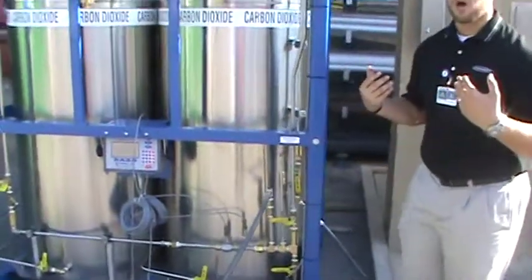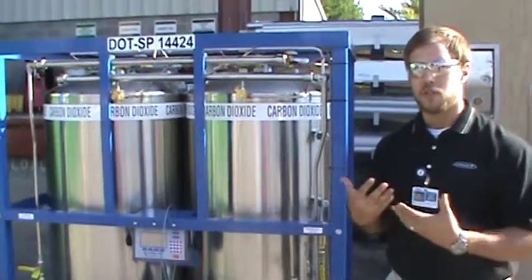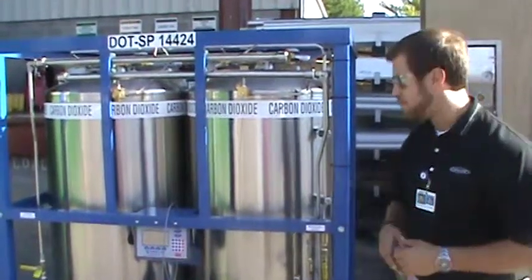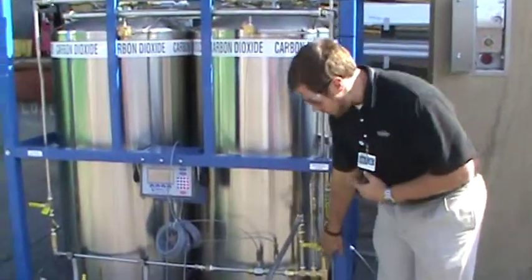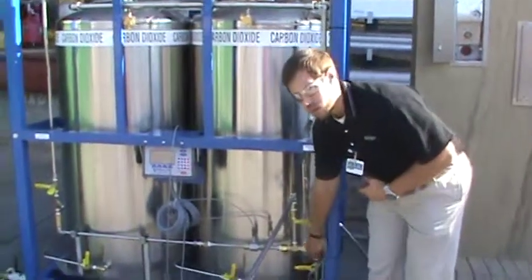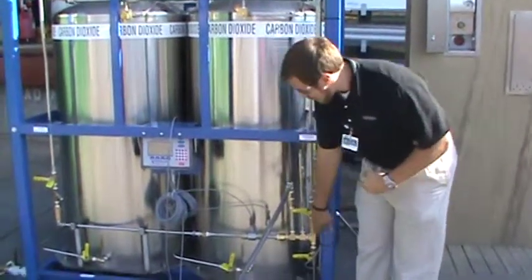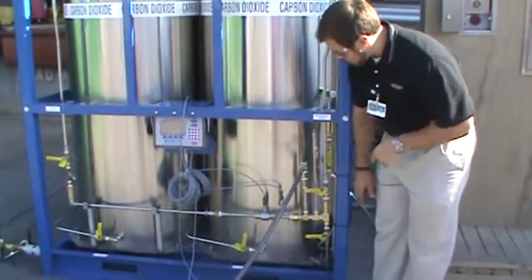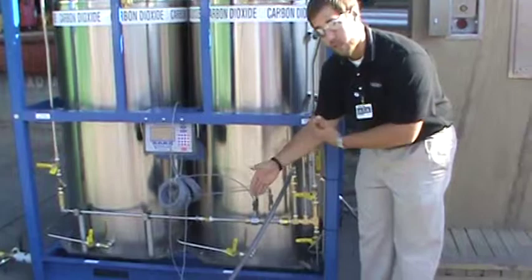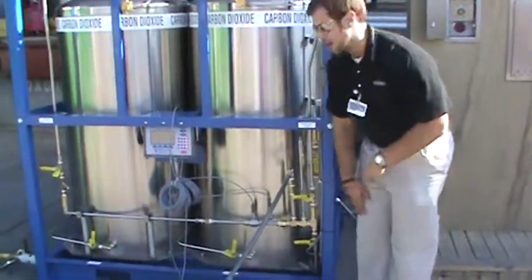Just as with all of your beverage tanks, you'll usually fill these by a pressure differential. When you vent, you'll open both of these valves. We do give you a check valve because it comes right by where you deliver liquid product from. Remember that even though we give you a check valve here, when you deliver liquid or when you are done venting, you should close both valves.